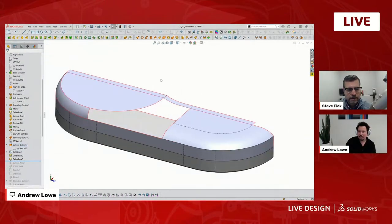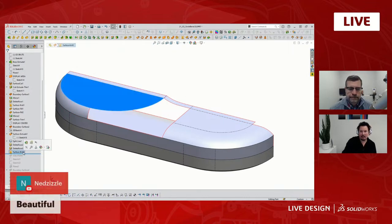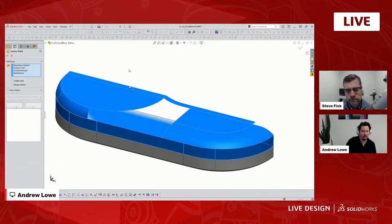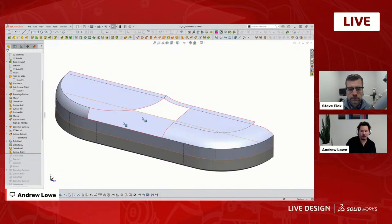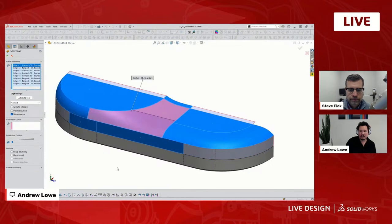Yeah, it's almost like custom reference geometry, right? Exactly. Using it purely so that you can build out the rest of the blend. One thing I found is that it can sometimes be helpful to knit this reference geometry into the model to have this closed five-sided perimeter. And from here, it's a matter of selecting your edges and defining the inputs.